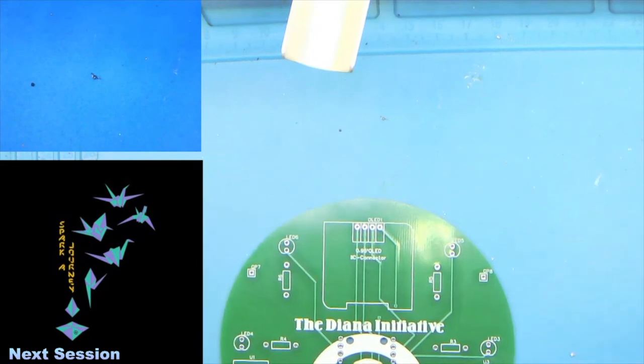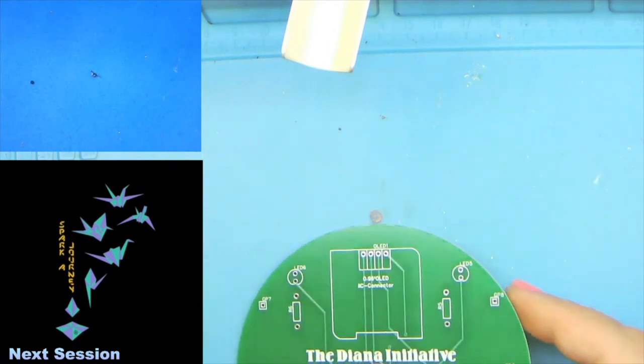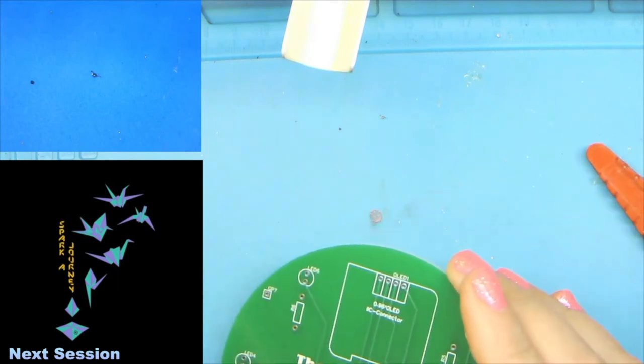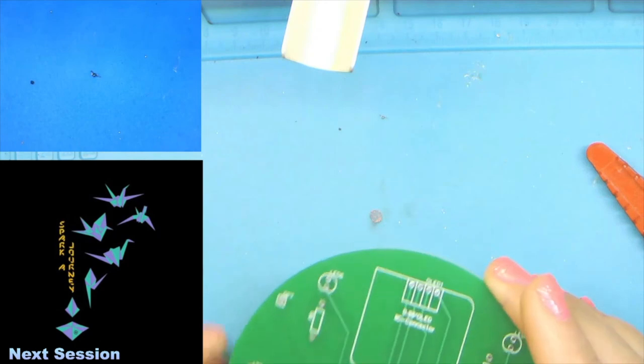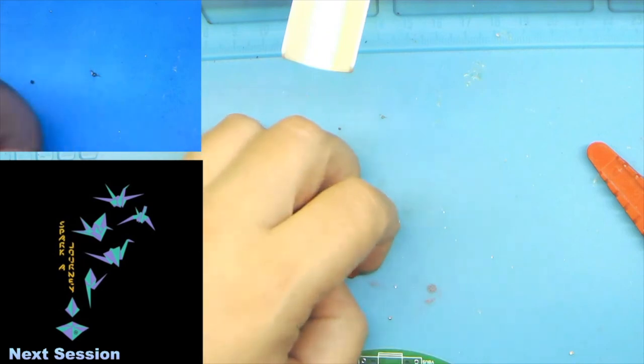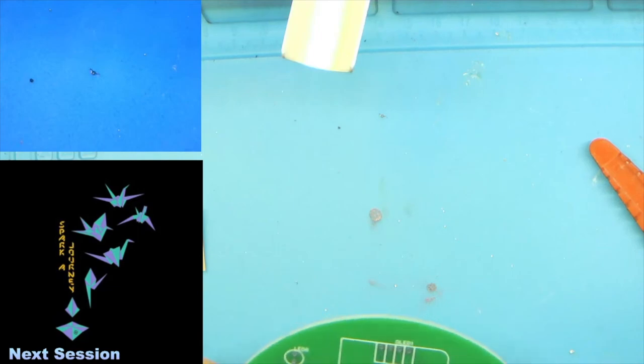We're going to do resistor 1, resistor 2. These are 10 ohm resistors. If anybody has been reading any Pi Pico documentation, they say 220. I don't know where they got the 220 from for their resistors. When I do the math using standard 2.2 volt resistors and 3.2 volt LEDs, wow, it's been a long day, the math is telling me to use what I put in the kit, which was 10 ohm for the blue and 68 ohm for the rest.